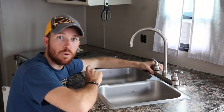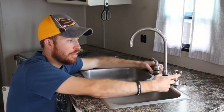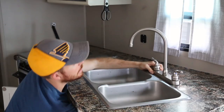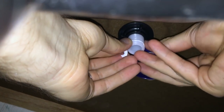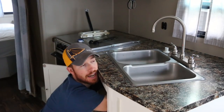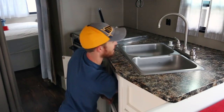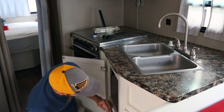One thing you need to make sure before you tighten it with the nuts: make sure your cold line is on the right side and your hot line is on the left side. This faucet has a blue indicator under the handle on one side and a red under the other, so make sure those are correctly placed before you tighten it onto the countertop. I'm going to tighten it now and make sure it's set in the spot I want. One of the last things I'm going to do is wrap a little plumber's tape and reattach the hot and cold lines. Now I've got the tape on both sides and I'm hand-tightening the cold line — it is very uncomfortable down there. Both are now nice and tight.